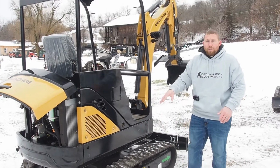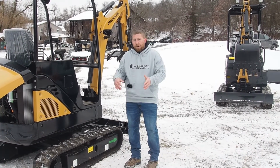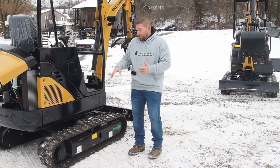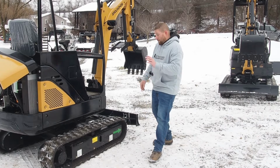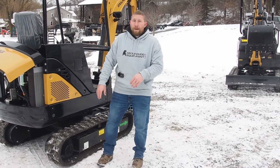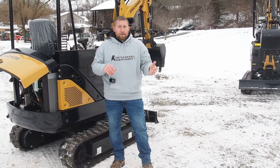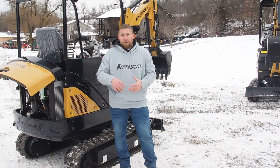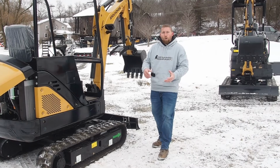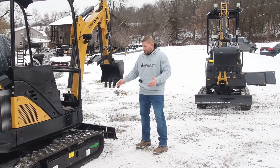And that's why some of these look different, because if you have a single speed unit, you have the drive sticking out the back, and that's where your hoses connect, and the spindle's the only thing rotating, compared to a 2-speed. Your 2-speed is the unit that's gonna have gear oil that you're gonna have to check. It's got a level mark and a fill mark. Your standard speeds are just going to be run off the hydraulics. You're not going to have any fluid that you have to check and maintain, like gear oil, like the rear differential of a truck.